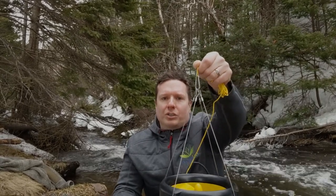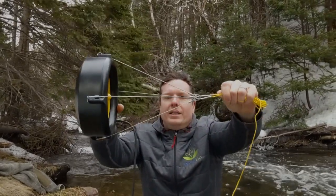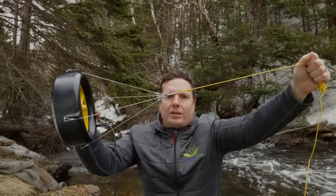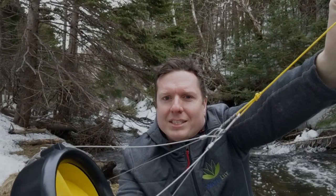Here's the tried-and-true go-to method. Bring all four lanyards together in front of the turbine and attach them to the end of your rope. Then all you need is an anchor upstream like a tree branch or rock — we'll cover anchoring in the next video. Any kind of trustworthy knot at the end of the rope is fine. I like to use the perfection loop, and you can find instructions on how to tie one on animatedknots.com.